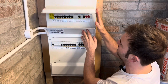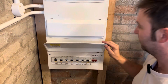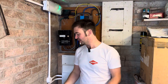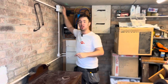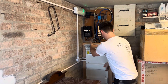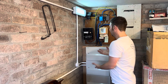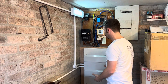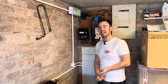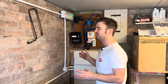I tried to space out the RCBOs as much as I could given the number of ways. That's the off-peak supply. There's the DB, the off-peak meter, and the on-peak meter. I've done an emergency light in the garage so that in case of a power outage the client can come in and this light will kick on — they can at least see and ascertain whether it's a supply problem. I tend to fit emergency lights in garages and under stairs — somewhere appropriate rather than in a visible hallway.